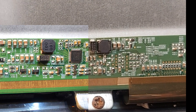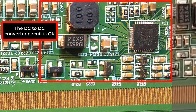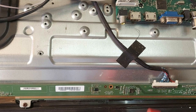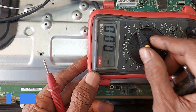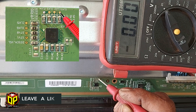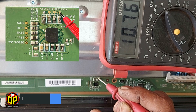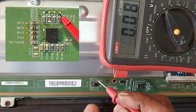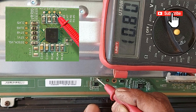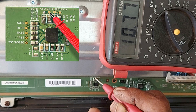If you see that these voltages are okay, then assume that the DC-to-DC converter circuit is working properly. In this situation, you will find the solution by measuring the voltages of the level shifter circuit. So note that CLK1 is 10.7 volts, CLK2 is 10.8 volts, CLK3 has almost the same volts.